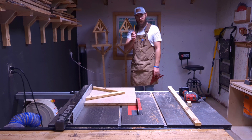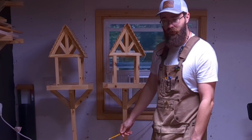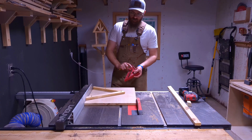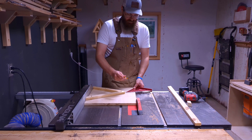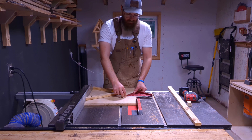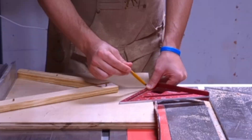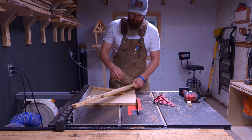Using the same method we laid out the perimeter of the bird feeder, we're now going to do this piece. This tip right here is at 60 degrees and it lines up in the center of that post. I'm going to take my speed square, repeat the earlier steps, angle it to 60 degrees on the outside surface area, and make a mark. The next piece I lay out is going to go on the opposite side of this fence. We're going to mark 60 degrees.